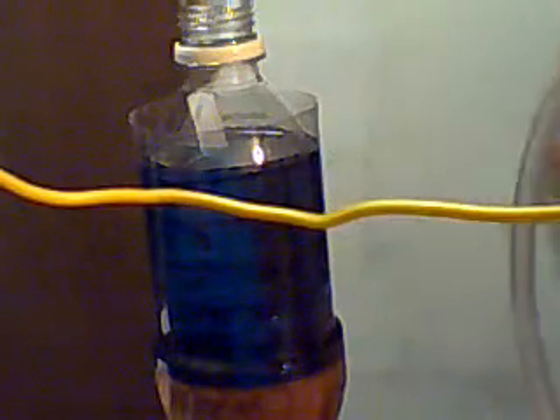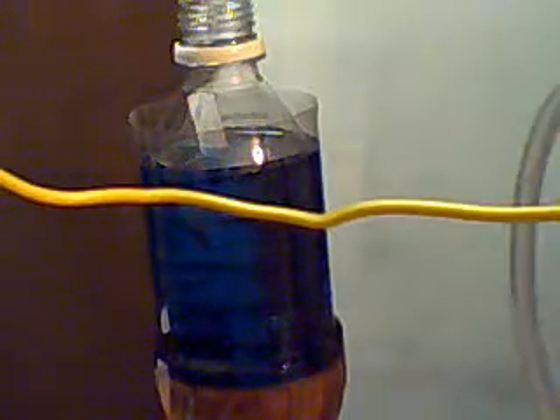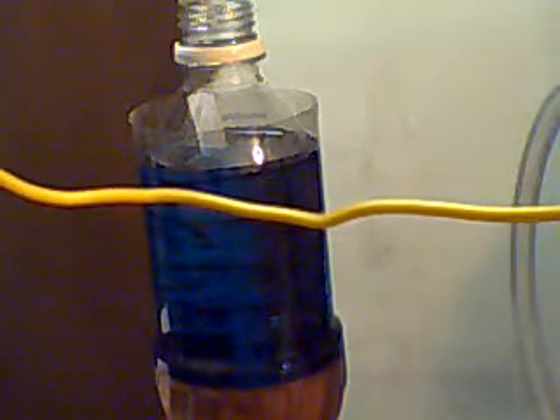This is the new cell. You can see the camera — I have it focused on the flow meter. I'm running right now at about 12 amps, 10 volts flat. My cell temperature is 126. It's been running for about an hour. This is with well water straight from my well — we've got pretty good water, it's not hard water, and that's important. And 4 grams of KOH.